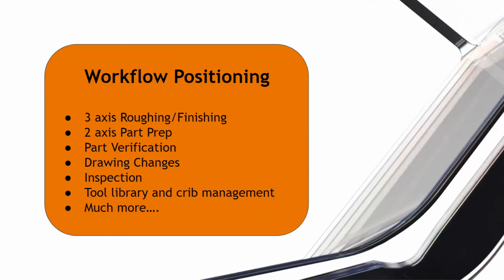So Fusion's tool library system is pretty involved, and you can make sure that a lot of your machines' tool libraries are up to date, right? So for example, if you had, let's just say, 10 machines spread across your shop floor, and you want to make sure that everyone on the floor knows which tool is in the machine at that current time. Soon after your programmers are done programming the part using Fusion 360, using things like online cloud libraries, again, these libraries are accessible to everybody on your team, right? Everyone can access this library, which gives people the confidence that, hey, I know for sure that this tool actually is in this pocket in this machine, because somebody just used it and they've updated their tool library.